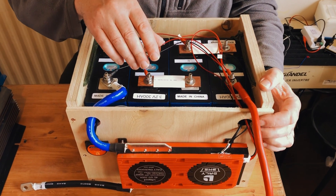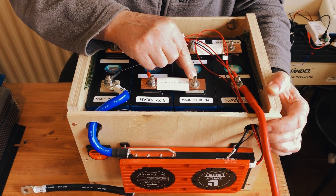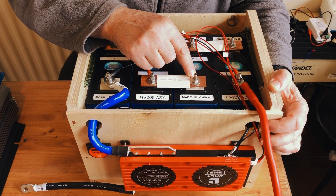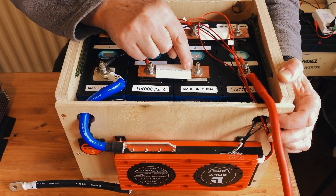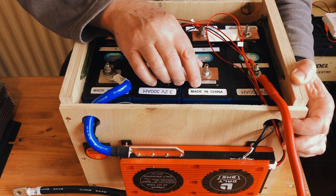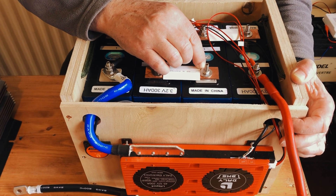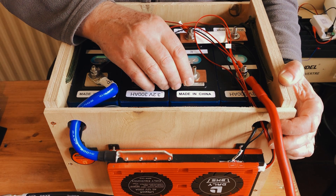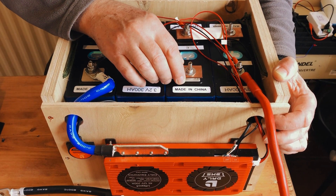These cells come with an M6 — six millimeter — threaded hole on the terminals. They are really shallow, and we believe they are manufactured by EVE, though we don't know for certain. The M6 hole is about eight millimeters deep, which is a fairly shallow thread in very soft aluminum. We actually tested eight of these cells total, and very early on, with quite a light torque, we completely stripped one of the threads and had to put helicoils in. We can't blame the particular seller entirely since EVE has sent many thousands of these cells out like this.